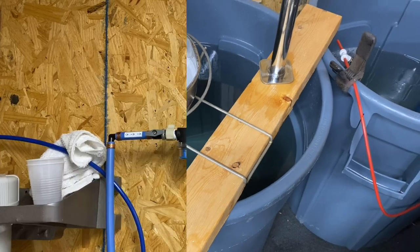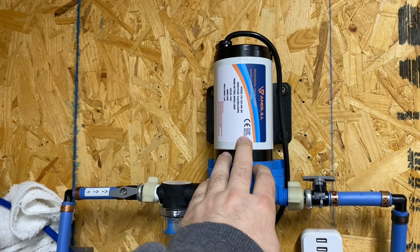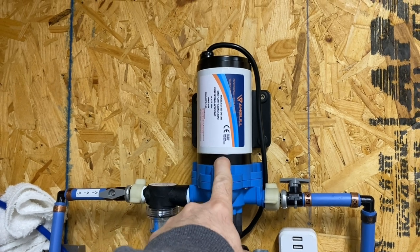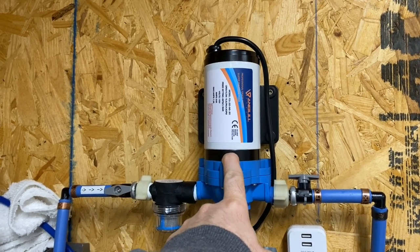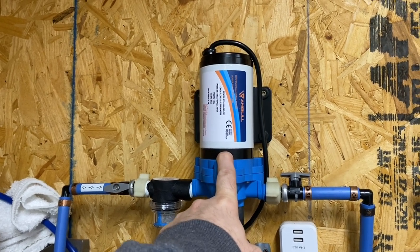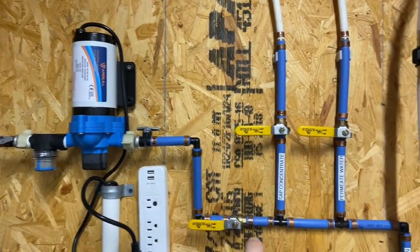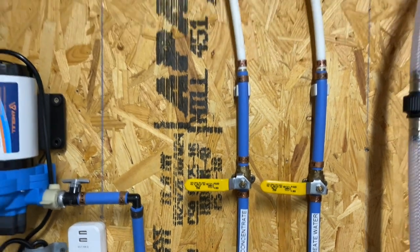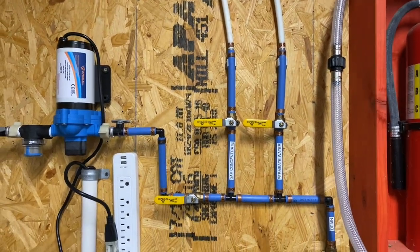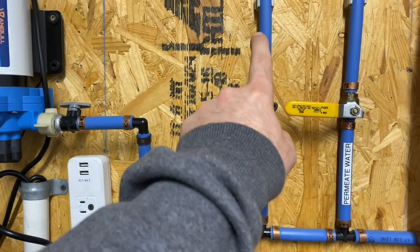This is the muscle of our operation — a diaphragm pump I found on Amazon, and I'll put a link in the description. The reason I chose this pump is it's also heat-rated; it's suggested as an inline pump for a hot water system. We wanted something heat-rated because especially when pumping sap concentrate through these lines, at end of season — and even in-season — we want to be able to send hot water through all of these lines to clean and disinfect.